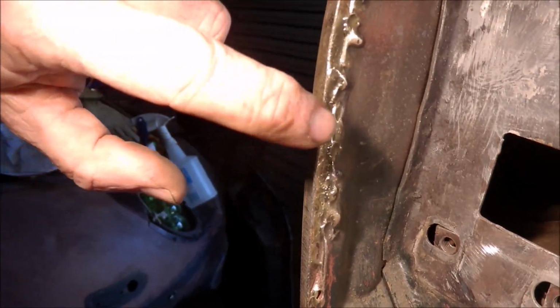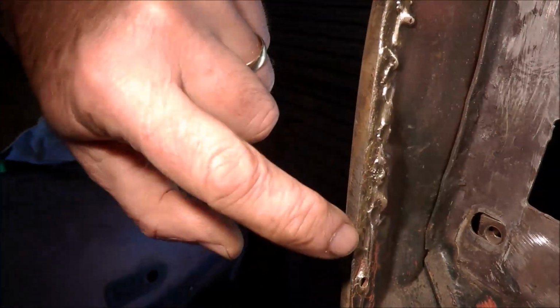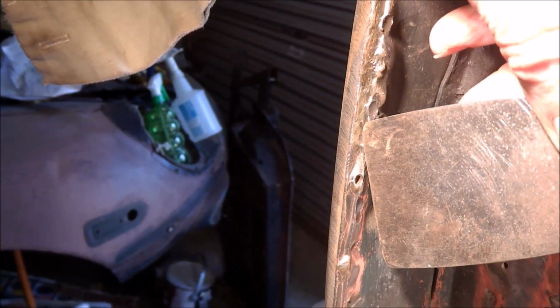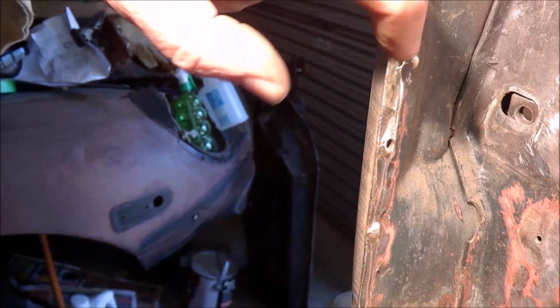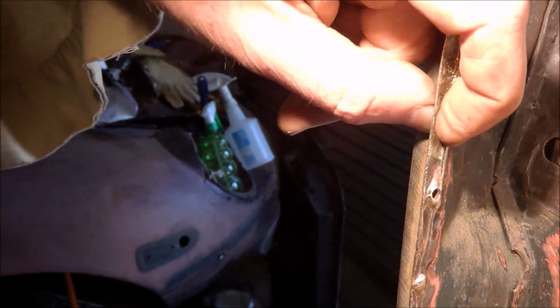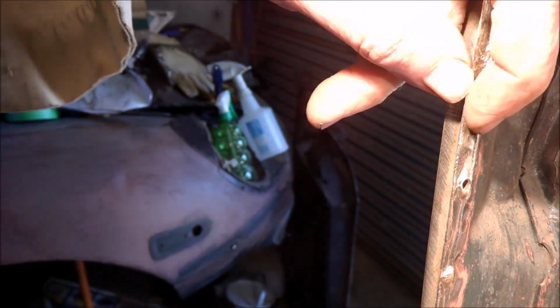Right, on the back, the A pillar, it's not wide enough, and there you can see that. But that's where the A pillar stops, and there's probably almost 1/4 inch where there's no coverage between the A pillar and the side panel. So when they tried to spot it on, it barely took. So the spot on the other side there is really just on the edge of the flange.